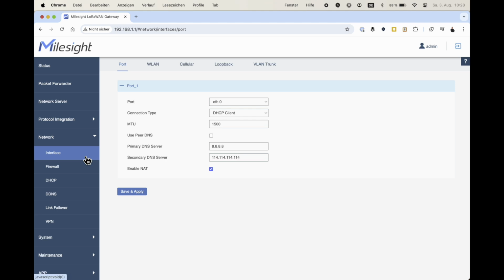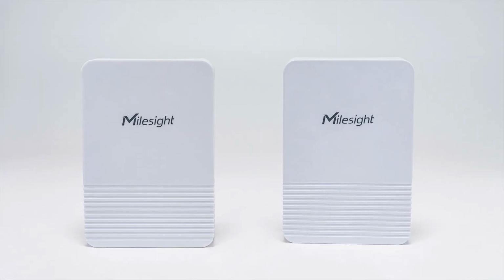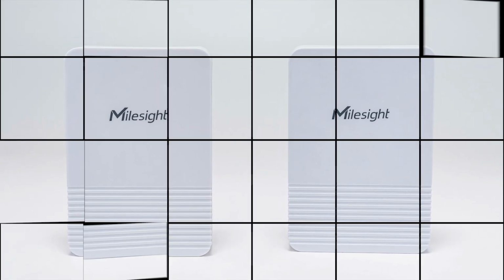Once this change has been made, you will no longer be able to log in via the Wi-Fi hotspot of the Milesight gateway. You will need to connect your computer to the gateway via a LAN cable to make further changes, such as adding more sensors or resetting the settings back to DHCP client.